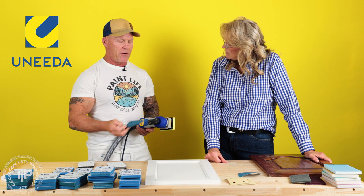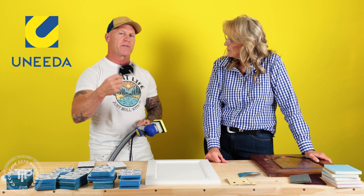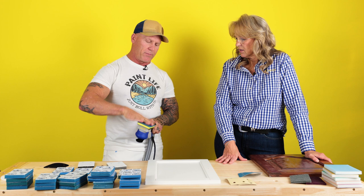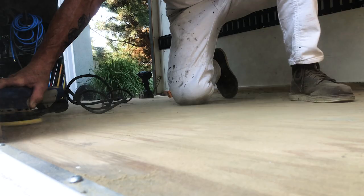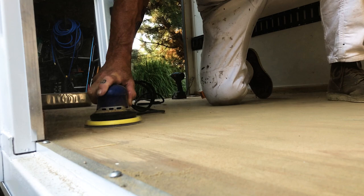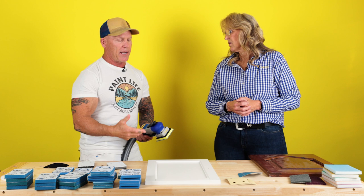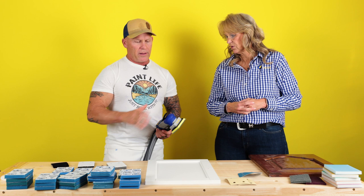When you told me that, I instantly related to it. When it comes to sander walking — if it was an employee using my sander I would always say to put a pad saver on so you don't damage the backup pad. But when I was using it myself, I would always just put the film tech on directly. A lot of times when I started sanding I would get vibration and the sander would start walking as soon as I pressed the on button.